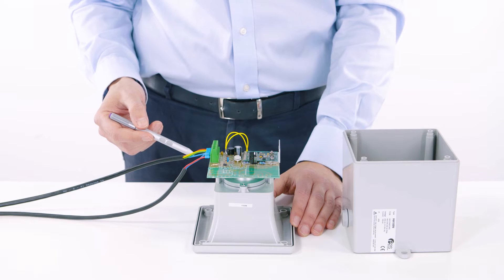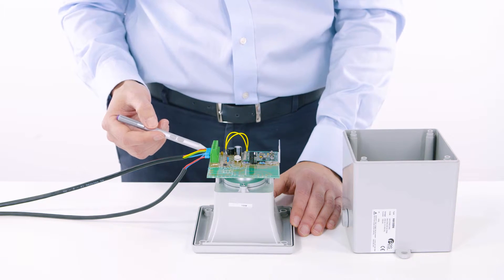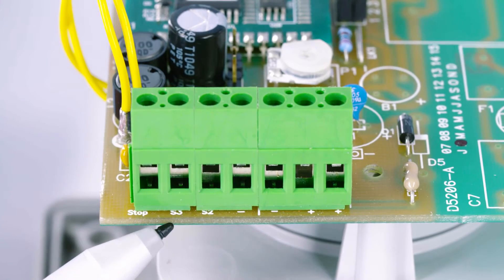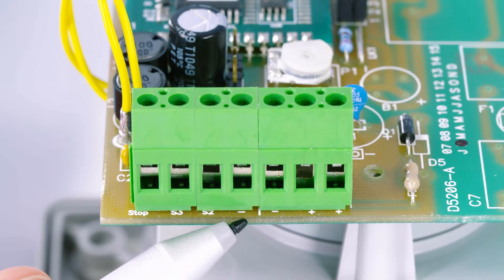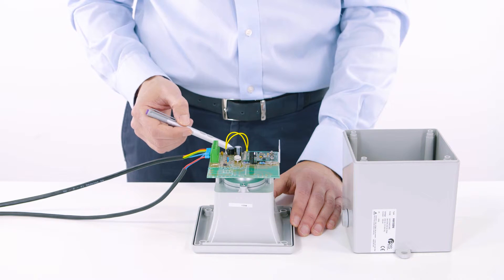Hootronic has three stages or channels of alarm. This allows a number of different traditional tones to be triggered from a single device to suit a number of warning situations. To remotely switch to the second and third stage sounds, cable into the terminals marked S2 and S3 respectively. To activate them, switch S2 or S3 to the negative supply whilst the unit is powered. Stage 2 and S3 override stage 1.